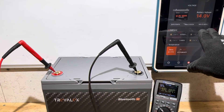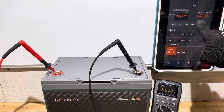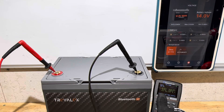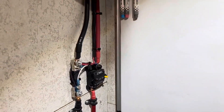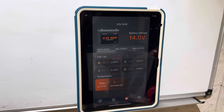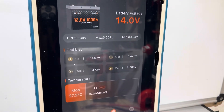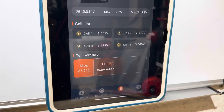Now checking the accuracy of the Bluetooth reporting from the BMS with the standalone meter. The battery Bluetooth app is showing 14.0 volts and the standalone meter is showing 14.04 volts. I've got the Truvelux connected to the capacity test rig — the same stuff I always use: the sampling shunt energy meter and the alpha inverter. We're going to test the capacity on this and see what it's got. But before I do that, I want to show you the Bluetooth right here — there's one page of the screen. The battery is at 81 degrees at the start of the test.